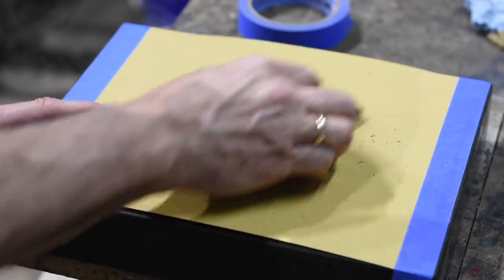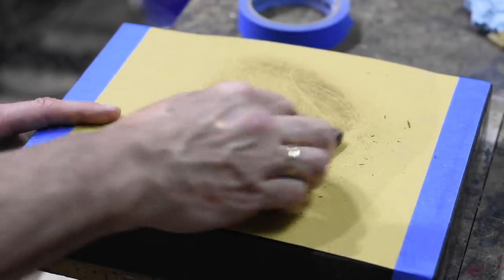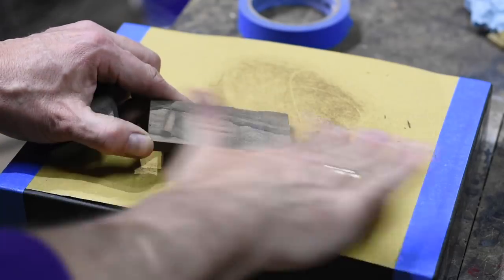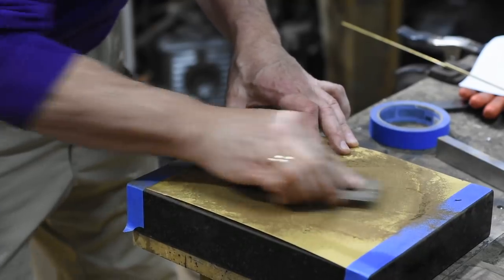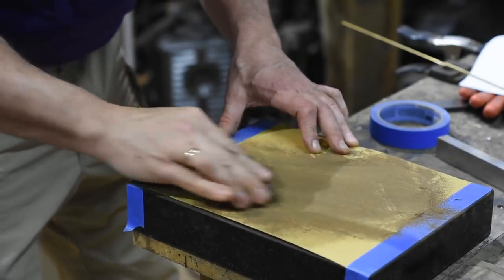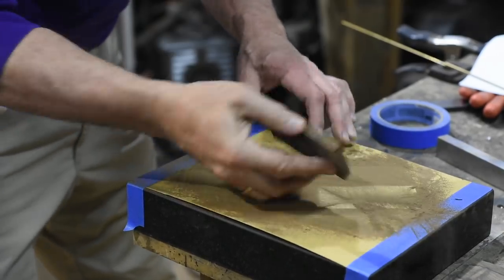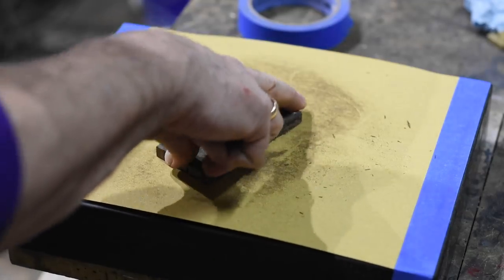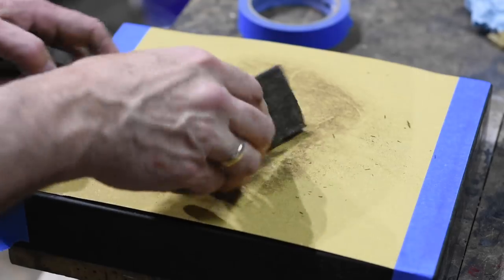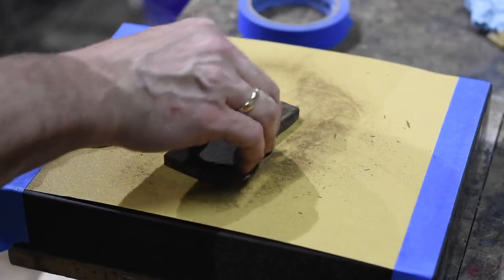If you use the sandpaper method, though, some things to keep in mind. No matter how flat the substrate is that you're using, if you do it wrong, you can cup the work or roll the edges or any number of other things that'll keep it from being perfectly flat. So, some tips. First, keep gripping the scales in different places. If you just hold it in one place, it'll tend to cut through in that place, and so you'll end up cupping out the work.